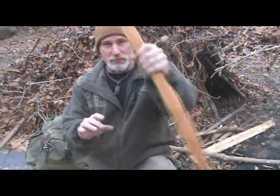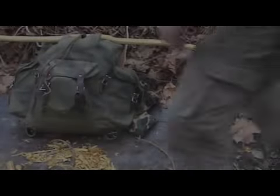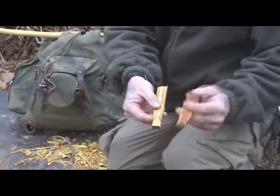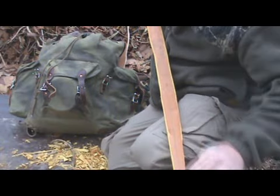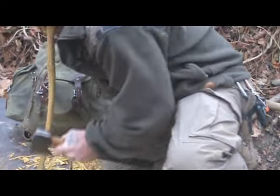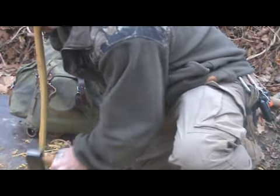We have decided up and down on this bow — this will be up, and it's more comfortable that way. There's already a little bit of an indentation here because of the way the wood bends. Now I've cut these two pieces off of our limb on both ends. I went back to work with the axe a little bit — I was a little off my center line on this side, so I'm going to try to get back closer to that center line with this limb.